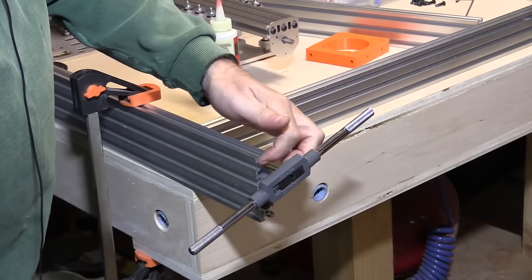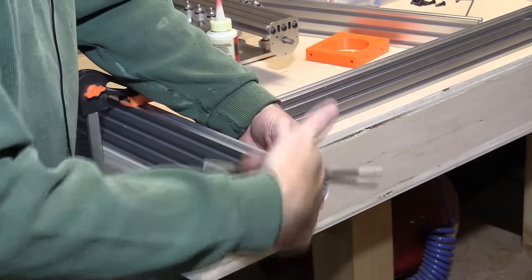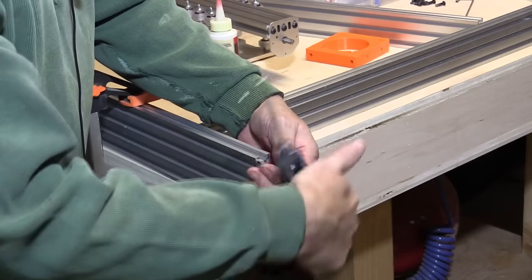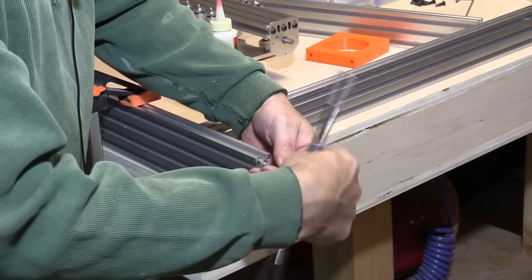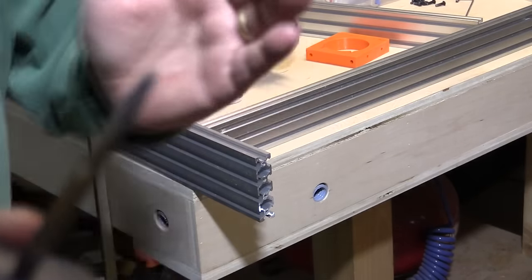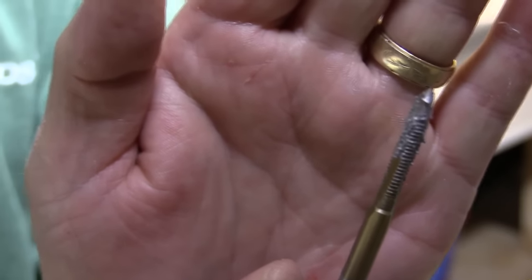Now I'm all the way in — I've got to the end of the cutting threads on here. I'll just unwind this. You should be able to just unwind it using a finger like I'm doing here. It should be easy to drive back out again. I didn't take this out part way through — you can do it, and it might make it go a little easier. If it feels like it's going well, then that's good. What you end up seeing now is all the cuttings, the aluminum on the end of the tap. You're going to wipe those off before you start the next one.